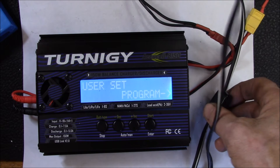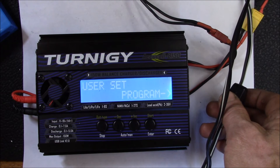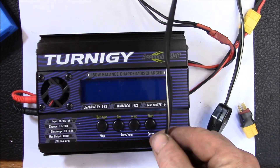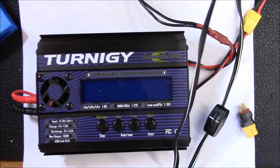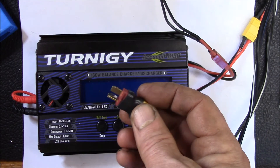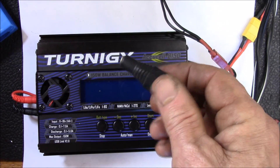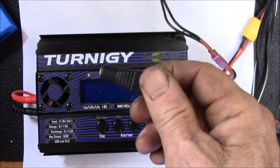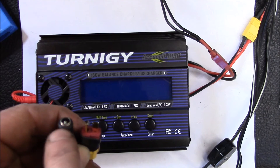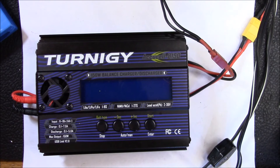I think I'm ready to go. I wanted a second charger and this has a nice on/off switch. I may build a better cable — this is just what I had on hand. This should make it easier to use since it now has the same adapters as my IMAX B6. I use Dean's for reasonably high current devices, coax power plugs for smaller things like LED lights, and Anderson power pole connectors for really high currents.